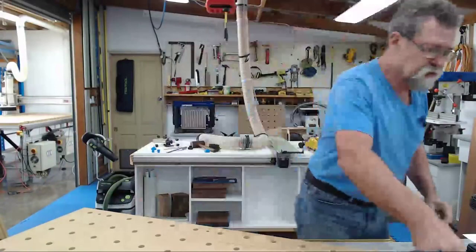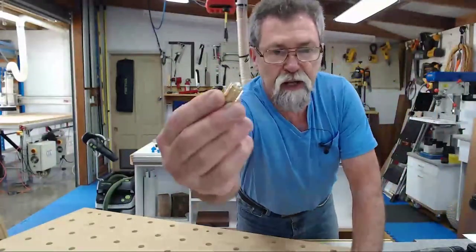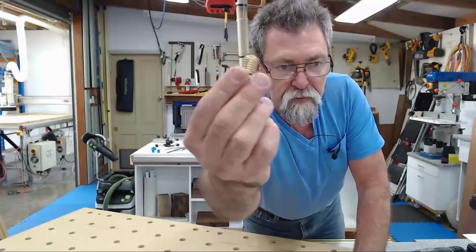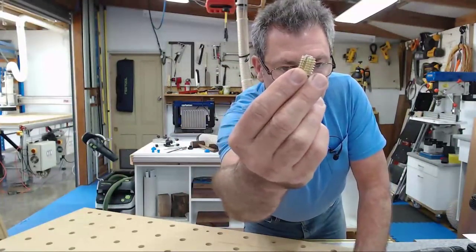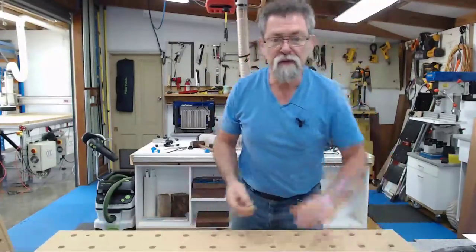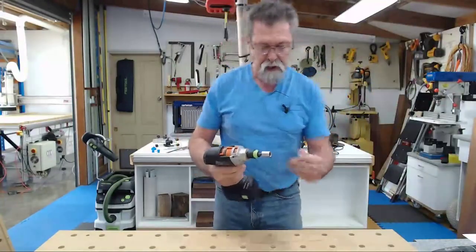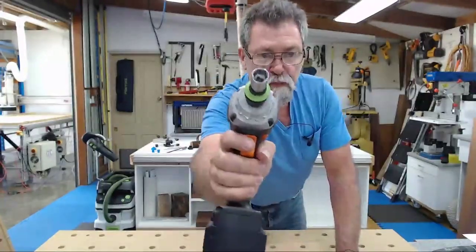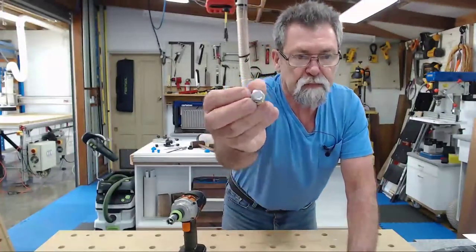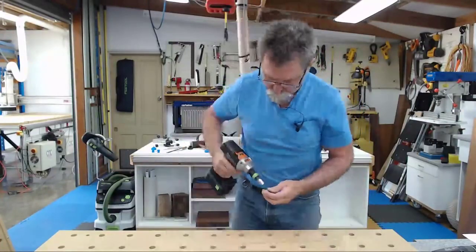And we're going to put the brass inserts in. Now these things here are the brass insert nuts. Now they're a knife edge. Up there. Good. All right. Now hopefully, I haven't tried this, so hopefully they're the right diameter that I made the holes. I can't see why it wouldn't be. And I'm using a small socket. I've put a bolt down the inside of the brass insert. See, there's the bolt with the washer. And that's how I drive them in, nice and straight.